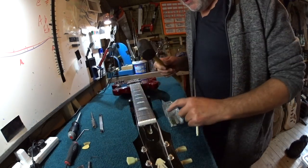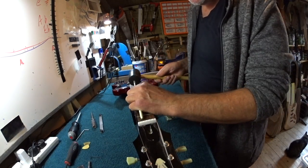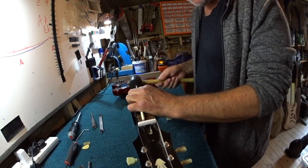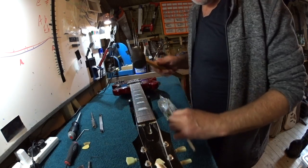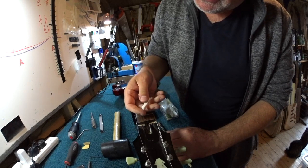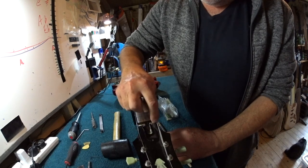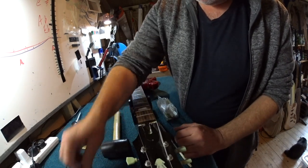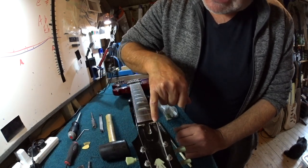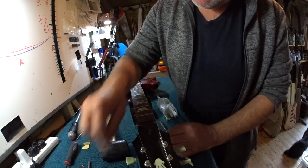By the way, coming back to the removal. This is just put in the slot. It isn't glued. It's glued in, but it's not poly'd over. Even when it is, you really still have to do that. There's no real way around it. What you do in doing it gently is you're trying to mitigate the amount of any finish cracking, and typically some of the poly finishes can be very glassy and thick. This is actually paint with what looks like a fairly thin clear coat, and that came off quite easily.